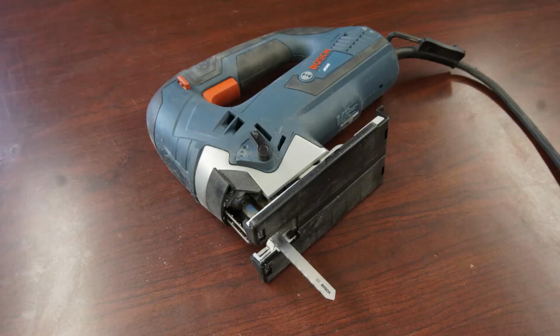This jigsaw blade has 24 teeth per inch. It's 3/8 of an inch wide, so that it holds a straight line quite nicely. If the jigsaw was previously mounted on a table, be sure to reattach the plastic shoe. The shoe will keep the jigsaw's metal bottom from digging into the pattern as you saw.